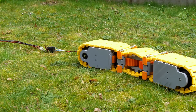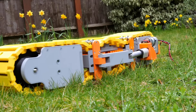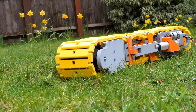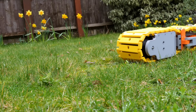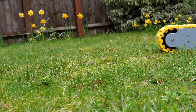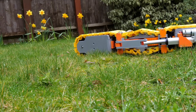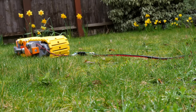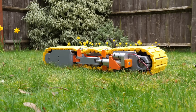It would be good to have rubber grips on the outside, and I thought about sticking rubber feet all along the tracks. But there's only about 3mm clearance where those bars on the outside hold the bearings, so rubber pads would almost certainly jam under the bar and the whole thing would seize up.